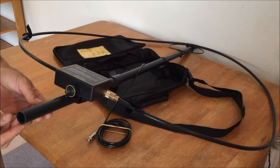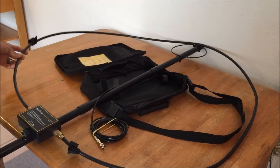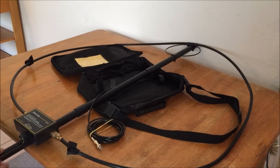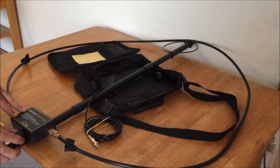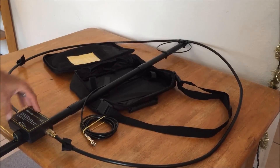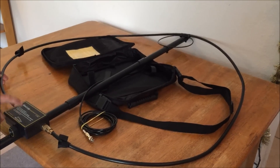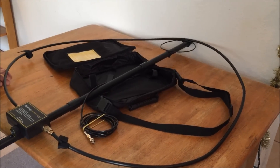This will go on a mount or tripod. If you're on a balcony mount, you can mount it vertically or horizontally. What you're going to do now is set it up outside and tune this knob. This is 40 through 10 meters, 7 through 30 megahertz. You tune this for maximum receive on the band you're at, then transmit at low power and watch your SWR meter — tune for the lowest SWR. It handles 20 watts SSB or 10 watts AM, FM, CW. Do not put more than 20 watts in or you will damage the tuner unit.